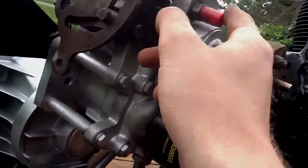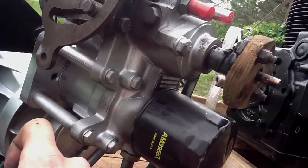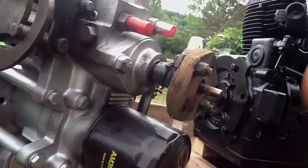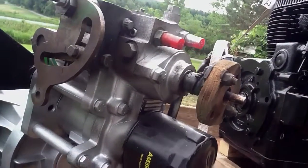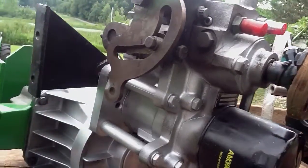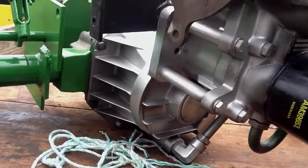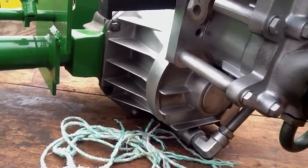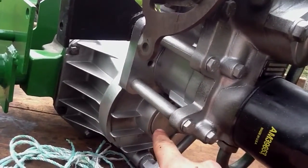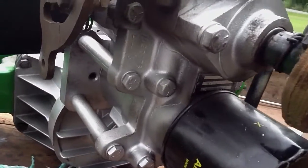This right here, from what the manual says, is just an auxiliary pump, which these two hookups here are for. It's a 3 GPM auxiliary pump for the basic hydraulic lift functions on the tractor — your angling cylinders or what have you. So apparently that hydraulic system has nothing to do with this pump on the back here. It uses the Dana 20 rear end as your reservoir. Here's your motor right here — it goes down through gears into there. It is a bulletproof, strong rear end.